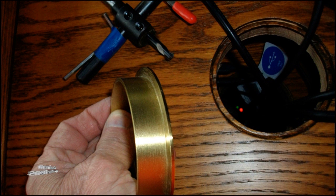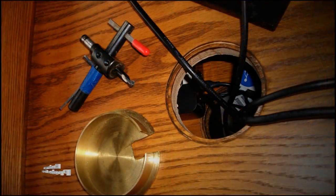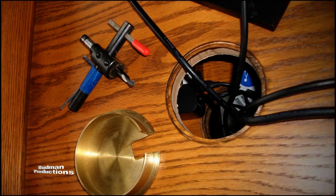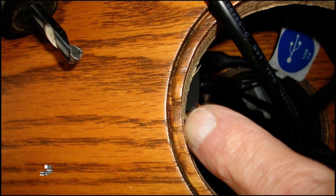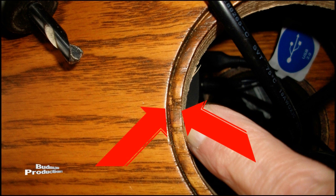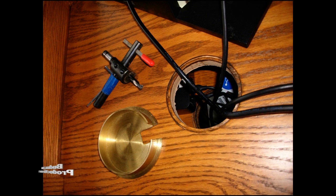I wanted to use the original wire access covers from my desk on the shelf. The challenge was I needed to drill a hole that these covers would fit into. So I purchased a hole cutter from the local hardware store. I first cut the outside edge, making it about the depth of the thickness of the cover edge. On my next pass I cut all the way through, leaving me a lip on which to rest the cover. The last step was to clean up this lip using a chisel.